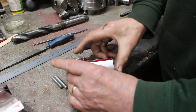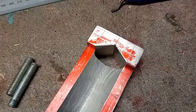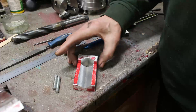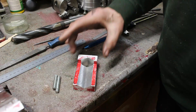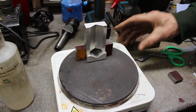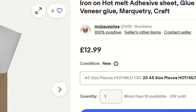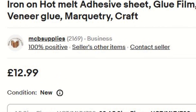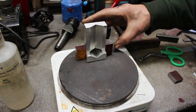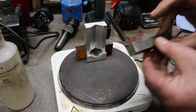So that has to go together like that. I think I'll initially just glue those together. When I'm sure I won't make any modifications I'll put a couple of pins in. I've got it on the hot plate with some hot glue sheet between the mating surfaces, and because it can move around as the glue melts, I've got some blocks around it just to keep it in place — I'll put one at the front as well.